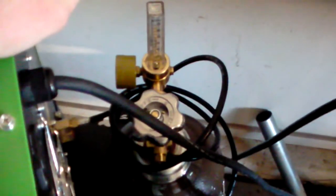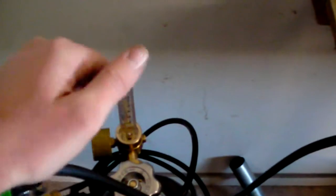That'll do your steel, your stainless, and your aluminum, and just about anything else that you are going to be TIG welding. There are some specialty gas mixes out there, but we aren't going to really cover those, as again, they are specialty. It's usually a specific build that uses those kind of gases, or a specific process. I'm hoping not to get too specific in this channel.